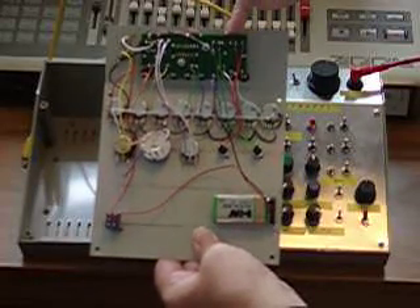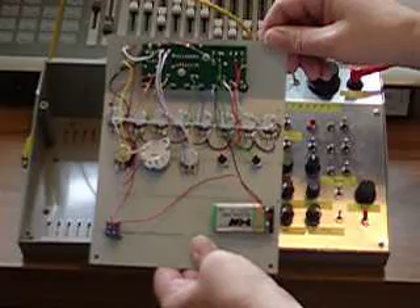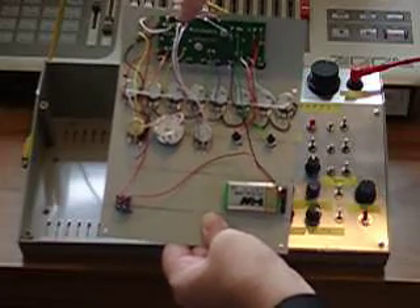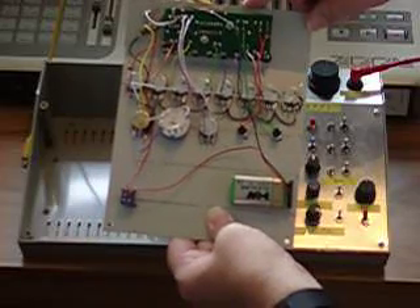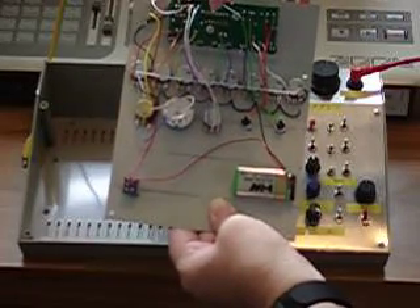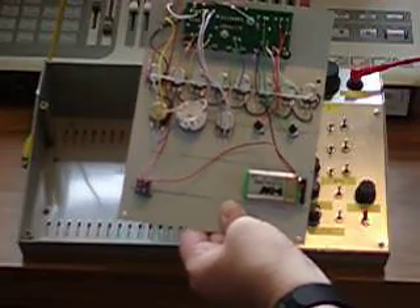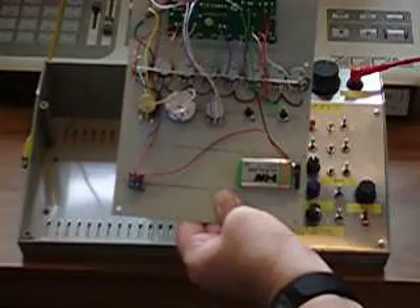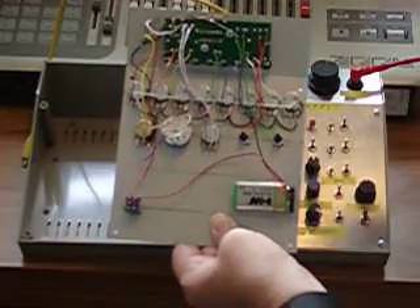Here's the printed circuit board mounted so the LEDs are showing at the front. The circuit diagram that comes with this shows very clearly eight control lines coming from the 4015 chip, each to a resistor which then feeds the LEDs. We need to make a series of eight connections at the point where the resistor connects to the eight lines on the chip. The resistors can clearly be seen between the LEDs on the front, and we make connections not between the resistor and the LED, but between the resistor and the chip — eight connections.